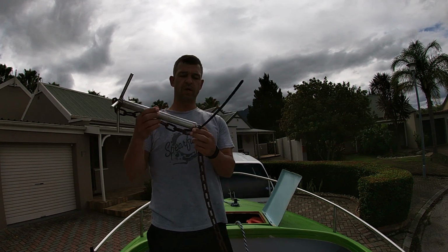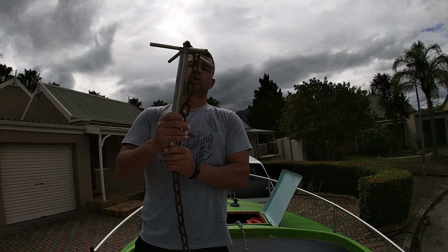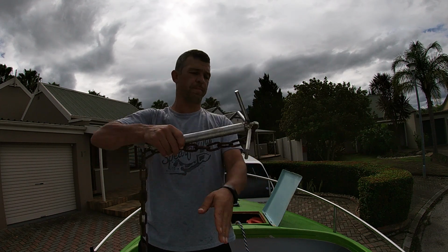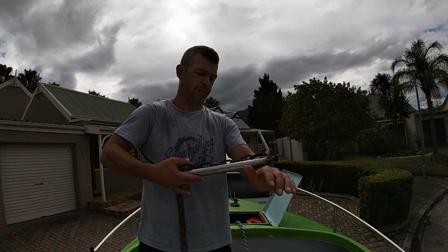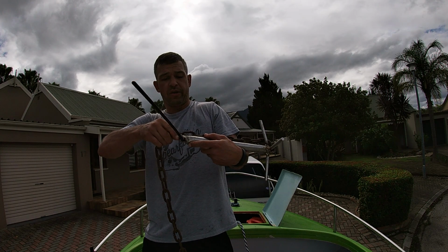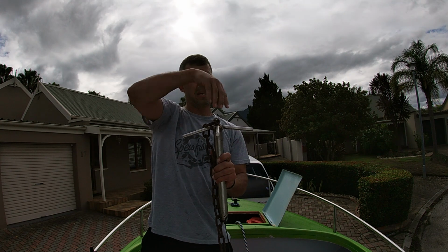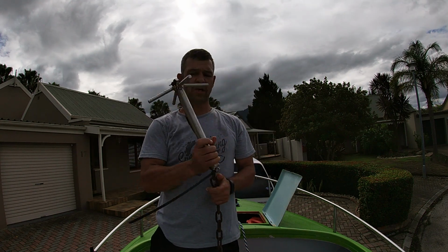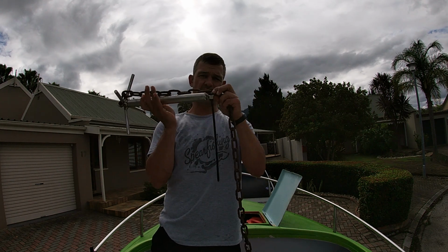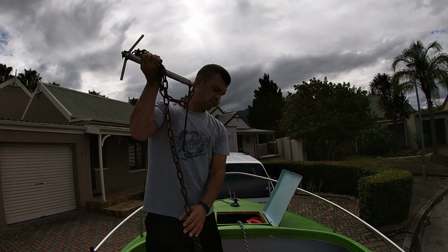Okay, so you can see, here's a cable tie here. I don't know, everybody's supposed to know this, but when we are anchoring on a reef, we put the chain on the top part of the anchor. So that hooks onto the reef like that. Okay, so now the anchor is stuck. Can't get the anchor out. So the cable tie in theory breaks away. As soon as the cable tie breaks away, you pull the anchor from this end and it comes up from the reef. Okay, so that's why we don't tie that down to the bottom part, we tie down to the top part, and then we use a cable tie on that other part. Okay, so that's one thing that I want to mention about the anchor.